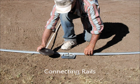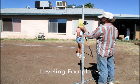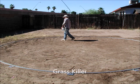The two most important things about above ground pools: make them perfectly round and perfectly level. So to make it perfectly level, I level each foot plate and the dirt under each rail. With the rails in place and level, I spread out some vegetation killer.